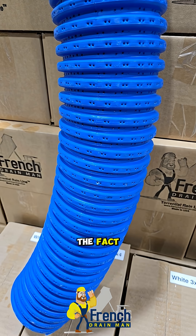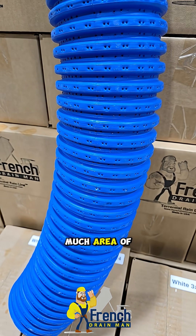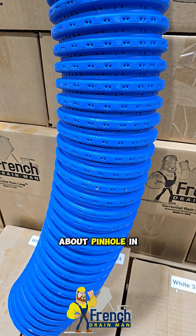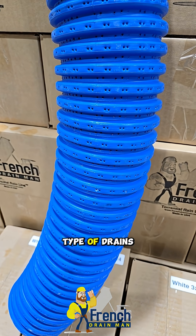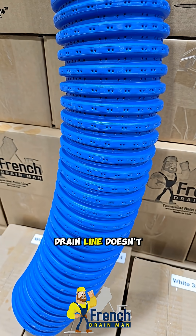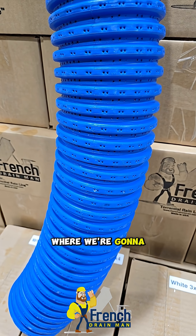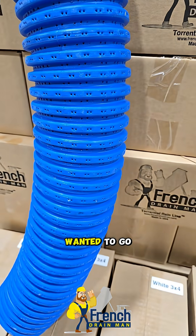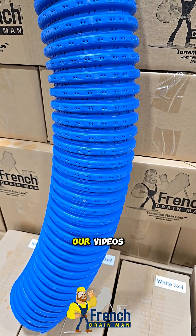I like the fact that you have all these little perforations 360 degrees. Look at how much area of this pipe is perforated. I like that about pinhole in place of knife cut for leach fields and for any type of drains where you're adding knife cut to the end so that the drain line doesn't hold water at the pop-up. The different things that you've seen us do where we're going to put catch basins on a French drain pipe — it's now going to be pinhole. I just wanted to go public and talk about that because the subscriber asked, as he started noticing it in our videos, and he's right.